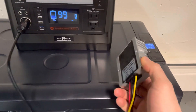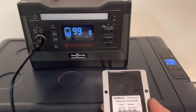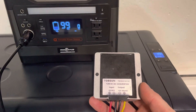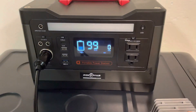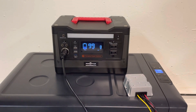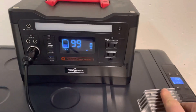One thing about this converter is that they're usually 90 to 95% efficient. So if I'm looking at about 40 to 60 watts draw, I'm losing maybe 2 to 10 watts max with this running. But if this allows me to consume more of the battery between charges — or when my solar isn't running, like at night on a hot summer day — then I think it outweighs the cost of the inefficiency of this little converter.